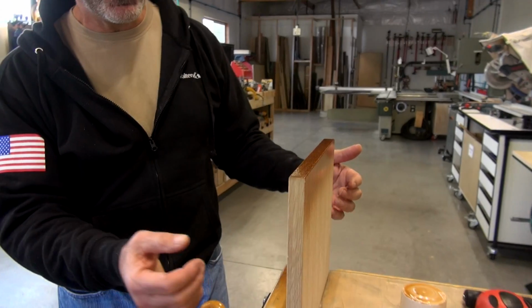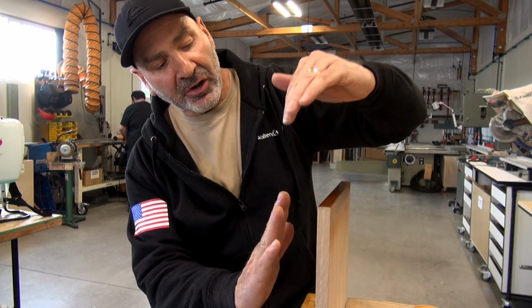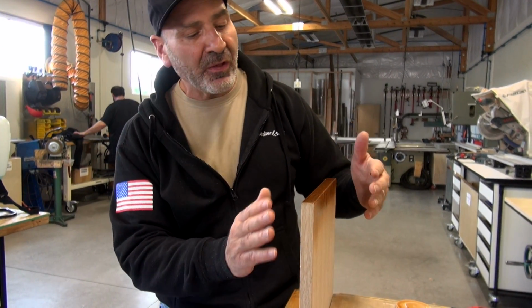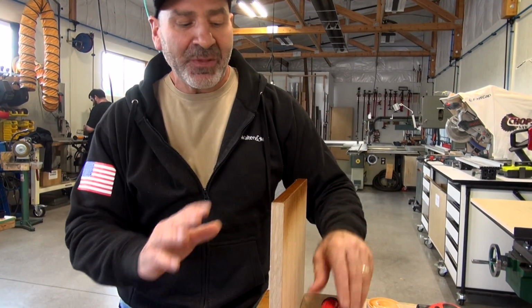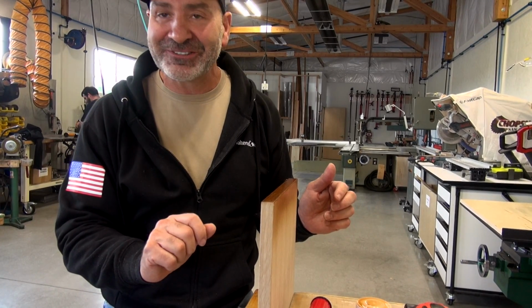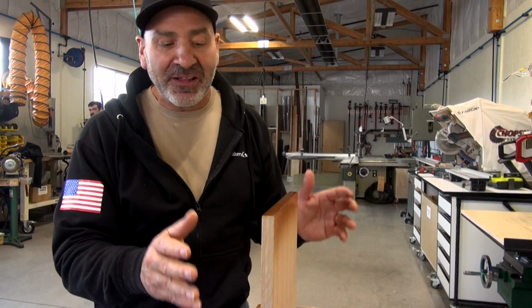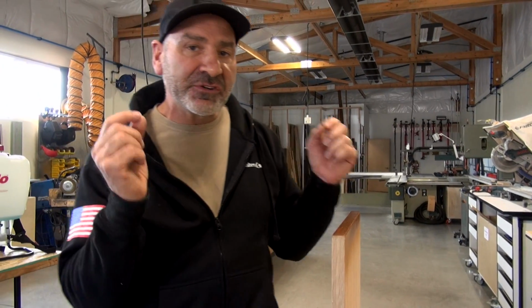So what we've done is we've sealed off the edges very effectively. We've actually created a lacquer barrier that's attaching the wood veneer to the side, as well as done a great transition with the fast break tool. Everything about this job was done correctly, except for my buffing through the lacquer just a little bit there at the end. But other than that, it's that simple to use Fastedge, and you can do it very easily if you understand the techniques. That's all there is to it. Hopefully that helped.